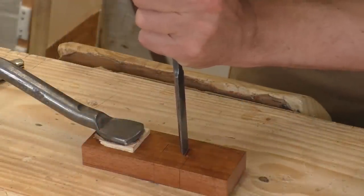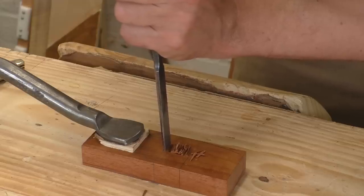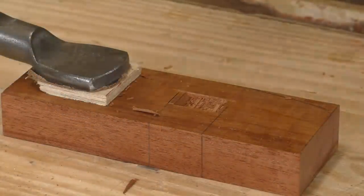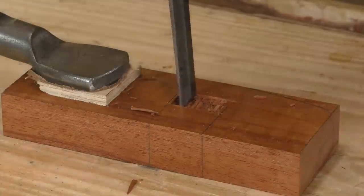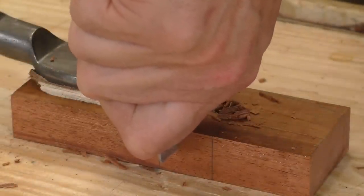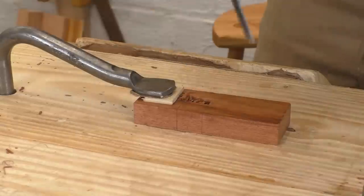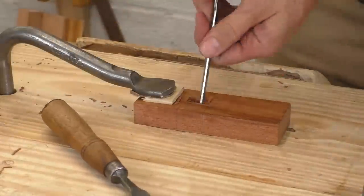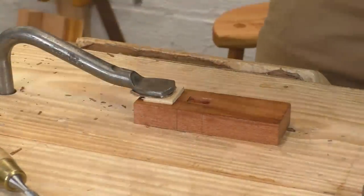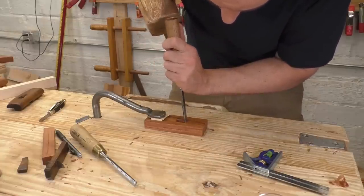Is this your first mortise? Don't worry — it's going to go just fine. Start out just inside your knife line, cut out most of the waste, and then trim the ends right up to the lines. Point the bevel of your chisel in the direction you're traveling and take little taps as you walk the chisel down the joint. When you get close to the end, turn around and do the same thing in the opposite direction. I'm still staying away from the knife lines on those ends as I come back through and take out another layer of waste. At the end, I can use my chisel as a depth gauge — I'm halfway through, or even more. Time to flip over. On the far side, I have the same layout — I used a square to carry it over from the other side. I do the same thing again: small taps and stay away from the knife lines. That's where I broke through to the other side. Now the hard part is done, and it's just cleanup. With the waste gone, I can get right in those knife lines and chop straight down for a crisp edge. I do this on both edges, and I'm done.